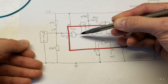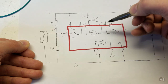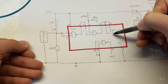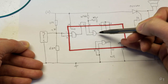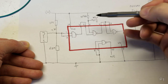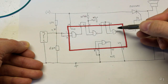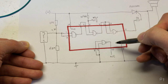So this will be active. And as we said, this is active because both of those are grounded, which means that this will go inactive. That's tied here, so to make it active again you put it through here, tie the two together — all this does is flip the logic. When this is off, this is on, and vice versa. So they're using the third NAND gate to flip it on. Once this capacitor is charged, and if this mystery device shorts to ground, then this output will turn active. The fourth NAND gate just has its inputs grounded and isn't connected to anything.